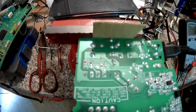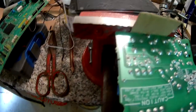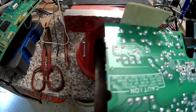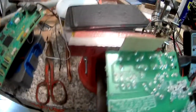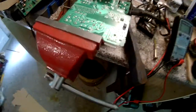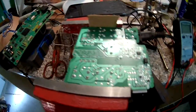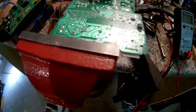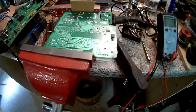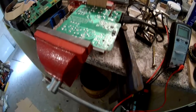The power supply also seems very efficient in standby mode. The big capacitor stays at a very high voltage for a long time — it starts out at 300 volts and holds there. The standby rails of 12 and 8 volts also hold up for quite a while. Seems to be a pretty good power supply.